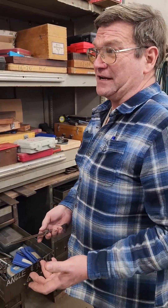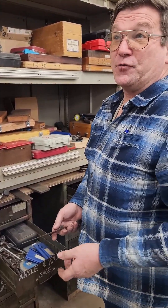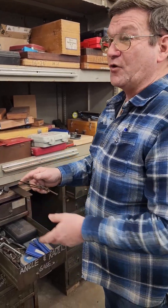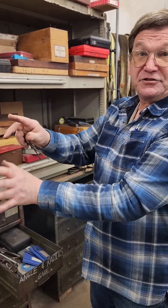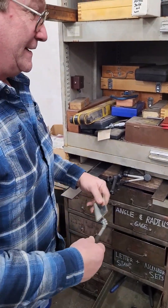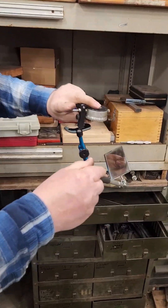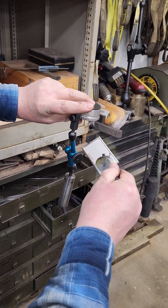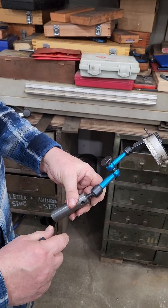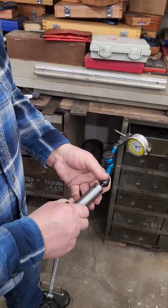I don't think I have any ring gauges — we make some by carefully turning and grinding them. You're not going to be any more accurate than the ring itself, but you can make some yourself. Normally with a ring gauge you're setting up a more accurate tool that might have multi-point contact — instead of just two contacts it might have three. Inspection mirrors work real well with indicators when you're dialing something in — it just gives you a way to see it.